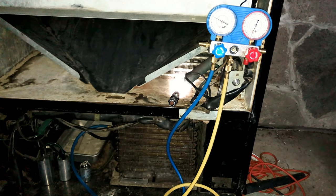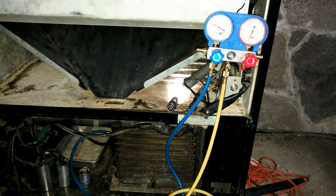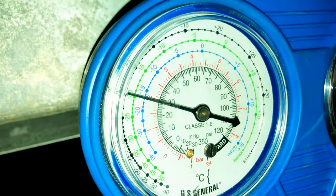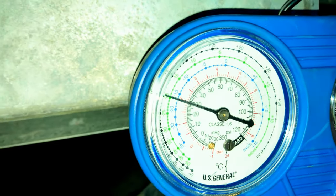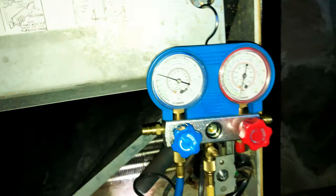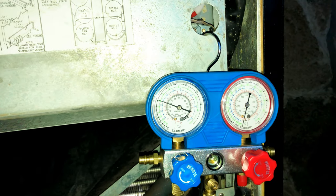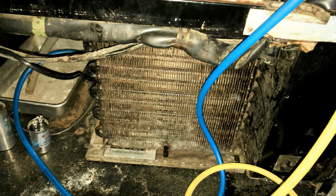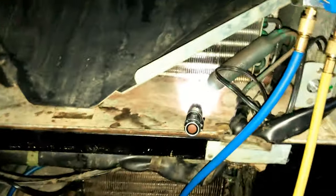And this thing is working absolutely phenomenal. We are holding now, it should be right around 30 PSI. Looks like I'm at about 29 right now, and it's been holding a solid 29 for almost an hour now. I got the door open because I'm watching it. And all the coils are cold down on the evaporator and the condenser. Everything's hot. Everything's exactly how it should be.